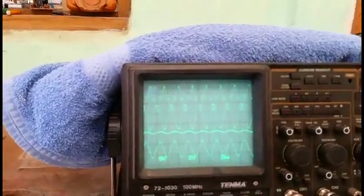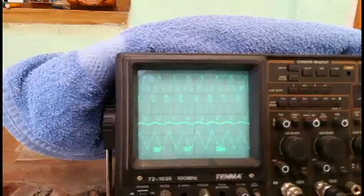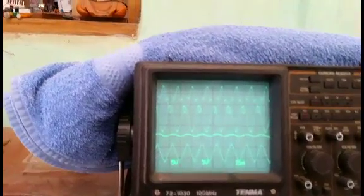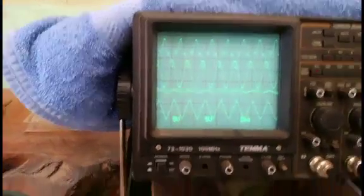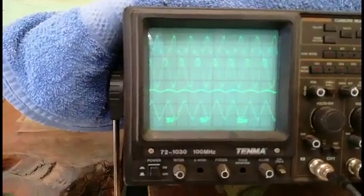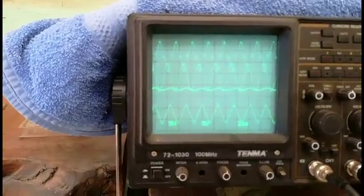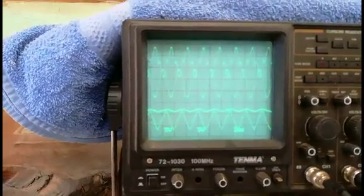You can see the current and voltage from the resonant tank circuit seem to be in phase. And we have on the output a triangular waveform, which is quite strange. I have never seen this type of waveform. You see current and voltage match, but we have a phase shifting relative to the primary, I think.